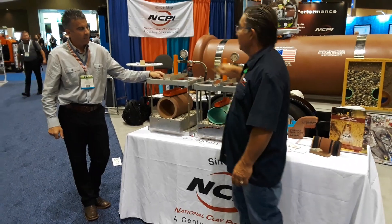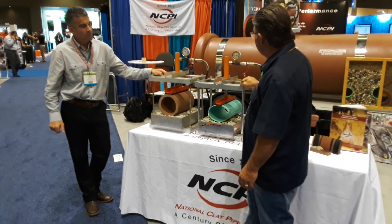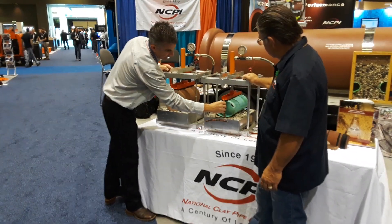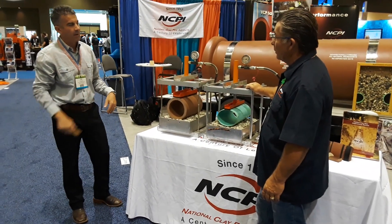And you have it up to 3,000 — pretty impressive. But it looks like the plastic can barely take 500. Yeah, it's about deflection. We've got a gauge right here, and it measures about 17 to 18 percent deflection with 500 pounds on it.